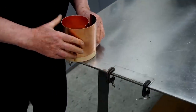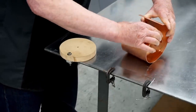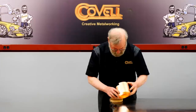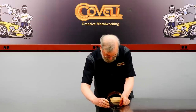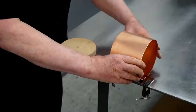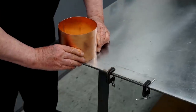It's looking really good up to about this point, and I'll unbend it a little bit more from that point, test it against my pattern — it's looking pretty good, I'll keep going. Almost done, and I'll hook this edge under my little holding fixture so I can unbend the opposite end. I'll try this against my fixture, and it's just about a perfect fit.